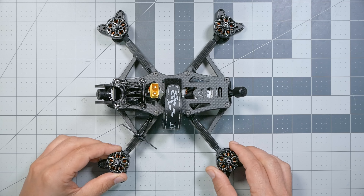The real place the AOS-5 stands out is something we can't demonstrate on the bench: its vibration and resonance characteristics. All physical objects have resonant frequencies — if something vibrates nearby at that frequency, the object will ring almost like a bell. Quadcopter motors make a lot of vibration, so if a motor spins at an RPM near the frame's resonant frequency, you'll get a huge spike of noise in the gyro data and the quad will fly worse. The AOS-5 has been designed to minimize these resonant frequencies or push them up to higher frequencies that aren't near the ranges quadcopter motors use. In other words, this thing is supposed to fly freaking amazing.